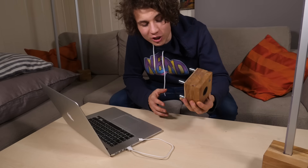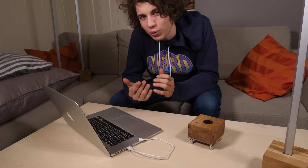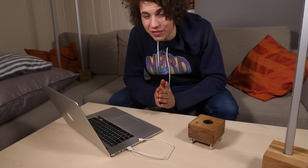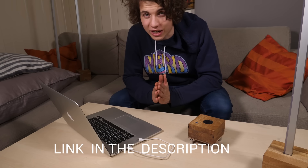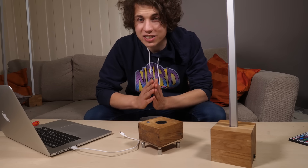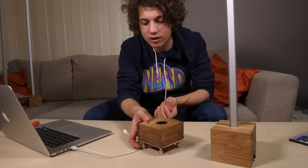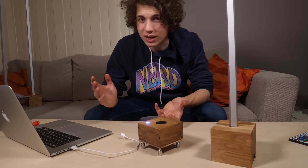All I have to do is upload the code for the controller and for the lamps. Luckily I have already written the code, so I will leave a link in the description so you can check it out. Now, the big question is how does this all work? It's actually quite simple to explain. When I power on this controller it creates a wireless network, much like the WiFi network that's in your home, which all of the lamps will attempt to connect to.